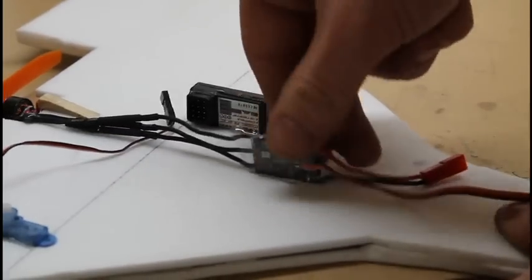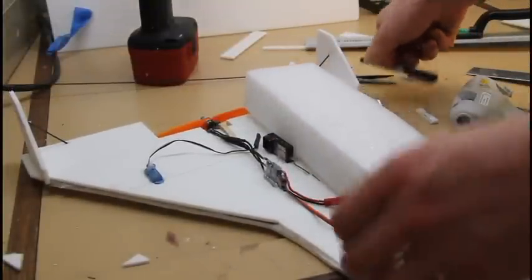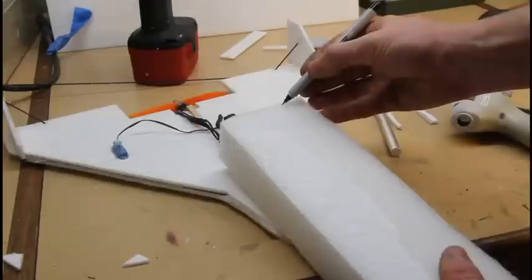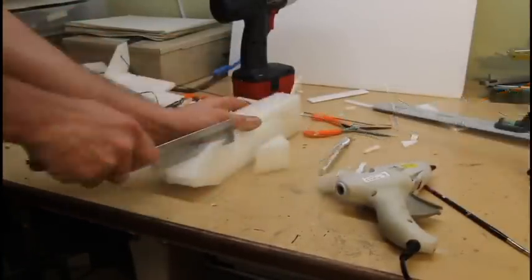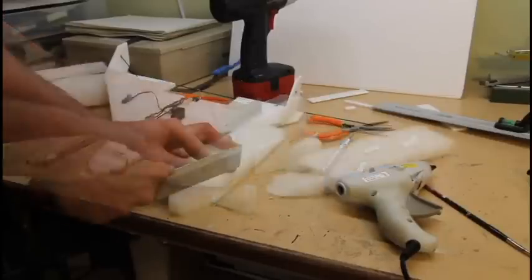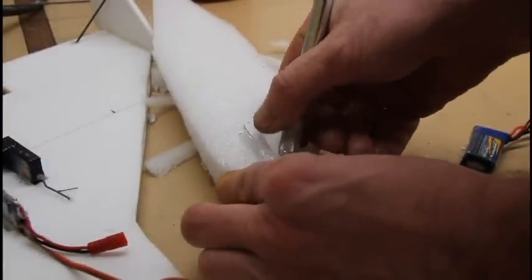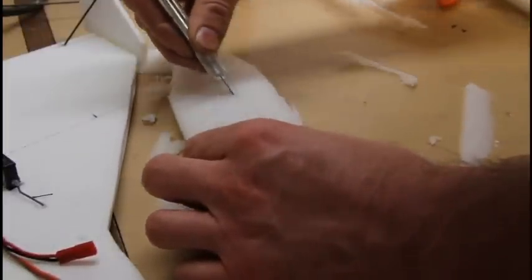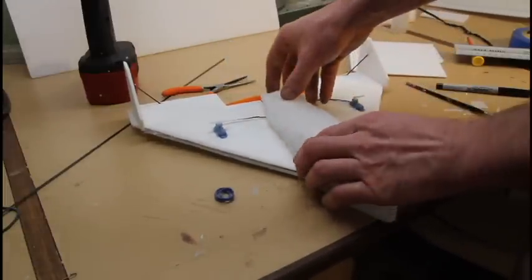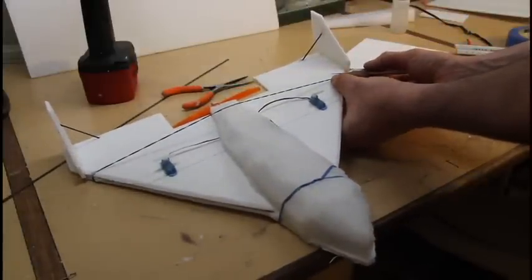Since it's not a big plane, you're not going to be flying it real far away because you're not going to be able to see it, so I haven't ever had a problem with receiving range. I'm doing the same thing with the ESC — I'm using a Hobby King 12 amp ESC. It's very much overkill for this application, but it's still pretty lightweight and it does excellent. I'm using some EPP foam — just some packaging foam, very soft and spongy but really strong and pretty easy to work with. I'm making a little cockpit lid to give it more dimension, and I'm also using it as a battery holder, cutting out the interior to give clearance for the components inside. This makes it good so if you nosedive it hard, that battery is going to be protected. You can use rubber bands, but eventually I end up using magnets to hold it on.